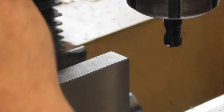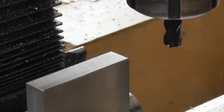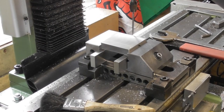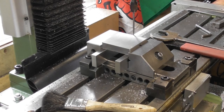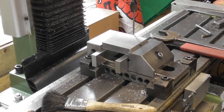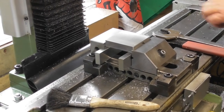It's a chamfer on what's going to be the top face of the block. I think I will file a small radius on the corners, and it's just more or less a break edge on the bottom face. So most of you will have seen me do this many, many times before. 1000 RPM seems to be my favourite speed for the wobbler. So touch on one edge, wait for the kick. Yeah. So X to zero. Let's go the other side.